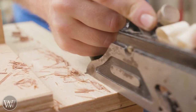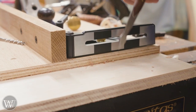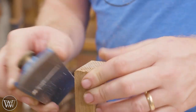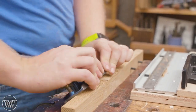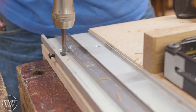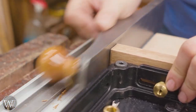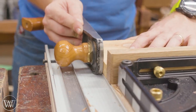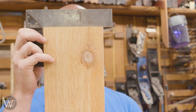For this one I need to take a little bit more — half-inch isn't quite enough — but with this rabbet plane it makes it very easy to come in and take off a little bit of material. I'm just taking off basically the top veneer, less than a sixteenth of an inch, to get the plane down so the iron is below the surface of the cutting board. Trim it off, make it nice and clean, then we can put the slide back on. For the fence we want to chamfer all the edges and make sure they're clean, except for the one edge that goes up against the iron. We can test it, make sure it's trimmed back, and then take the whole thing for a test drive. That is happy — we have a working shooting board!